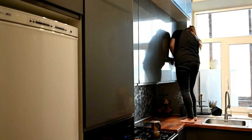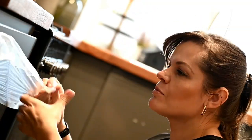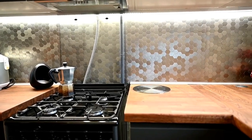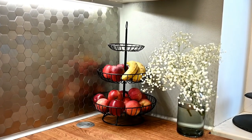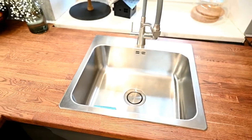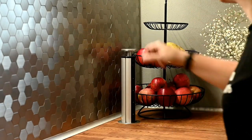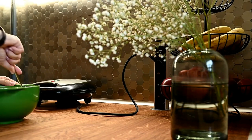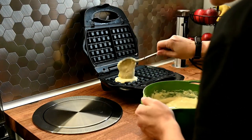At the very last moment, the final thing to do is remove the safety film from the kitchen doors. I really love how our kitchen looks now after the renovation. We did this about a year ago and both the countertops and the backsplash are holding great — no stains or anything. I love that the countertops can be restored easily if anything happens — stains or scratches — we just resand that part and treat it with oil again. The oil makes no visible borders when applied like this. I actually tried this to remove a stain I made by accident when cleaning the stove with a fat-removing solution, and it worked like a charm. I highly recommend this oil — Rubio Monocoat — if you can find it in the US; it's a Belgian product.